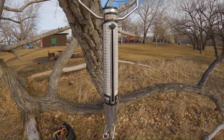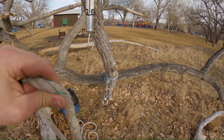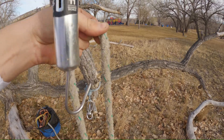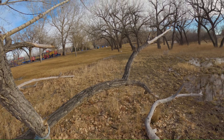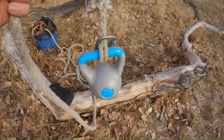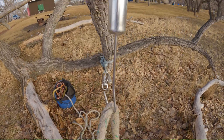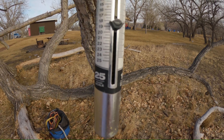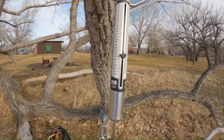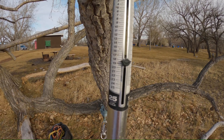We've set the fish scale back to zero, still hanging in the same spot. I set up a porter wrap down there which we'll be needing later. Now I've attached the kettlebell to this rope — it goes up through the fish hook and then down back into my hand, which represents a porter wrap. This should roughly double the weight on the rigging point. So now instead of 10 pounds, it's seeing roughly 20 — about 18 and a half on the scale.